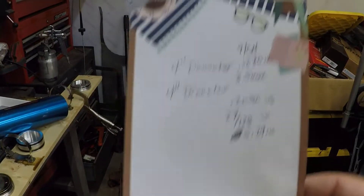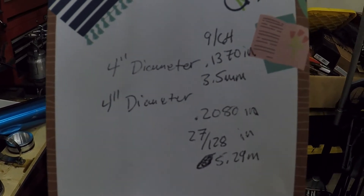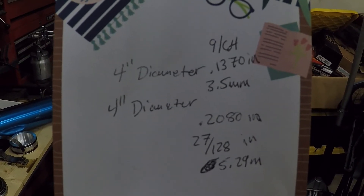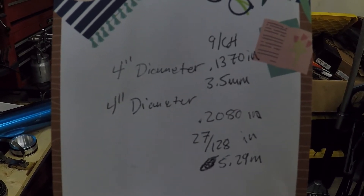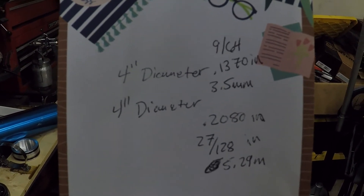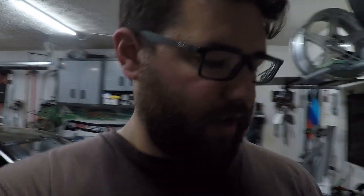I'm going to measure the thickness and diameter of all those O-rings so that if I need to do this in the future, I can pick them up locally or order them from McMaster-Carr. Both were four inch diameter with slightly different thicknesses — I wrote down the thickness in fractional decimal and millimeters. They're just black O-rings, directly from Canton, and they work with both two and three quart AccuSumps. The thinner O-rings go on the caps and the thicker O-rings go on the piston.